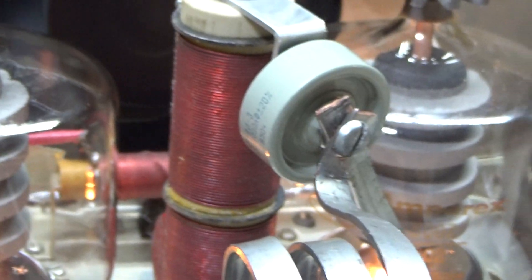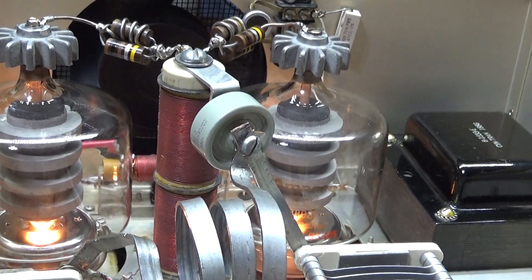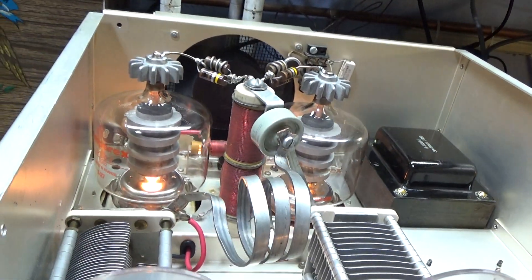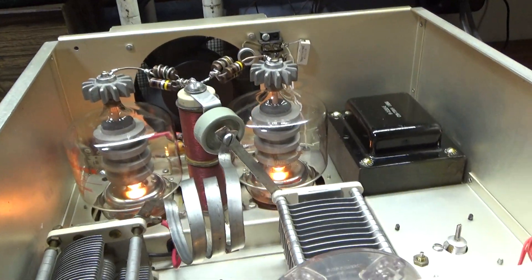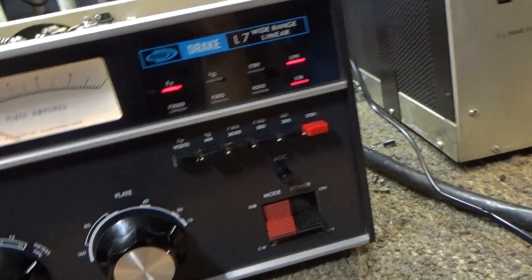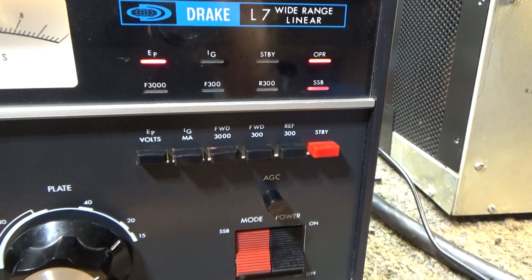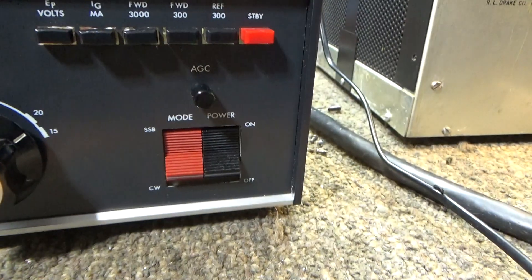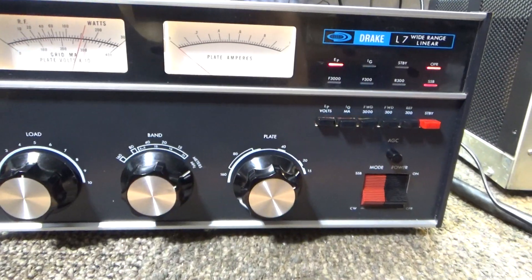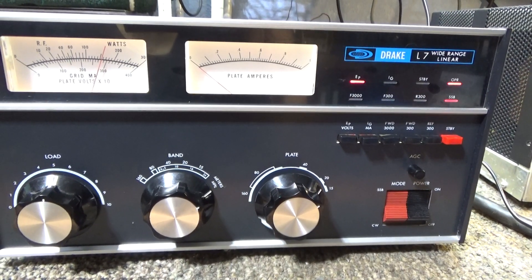It's still a very nice build. It's live — I got it on high, so I've got 2700 volts in there. I'm a foot away from this just zooming in with the camera. Separate high voltage power supply, filament transformer, two 3500Z tubes. This one has been mono-banded — just a tune cap, load cap, tank coil, about four turns. Instead of a band switch, it has a variable bias. The front has nice lights and a multimeter. It's on high voltage right now — plate current meter, SSB/CW, high/low, on/off switch. A very very good grounded grid dual 3500Z amplifier.